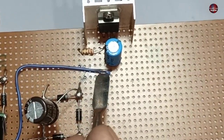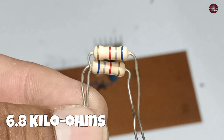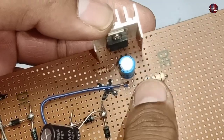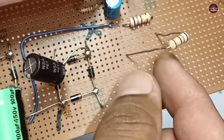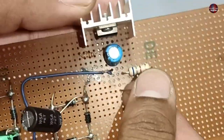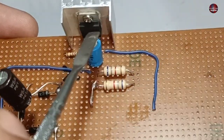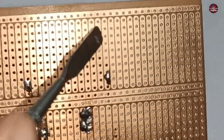As you can see, I have changed the position of the jumper wire, as it was at the back first. Next, we need two resistors of 6.8 kilo ohms of half a watt, and I will use them to make a potential divider, which will divide the voltages. We will install the first resistor at the regulator output or positive capacitor point. I have inserted the first pin and the second anywhere in the Vero board. Now I will install the second resistor with the first resistor on the right side, and the second pin with the ground, which is the center pin of the voltage regulator. It could be grounded anywhere with the neutral point, but this is the nearest point. As you can see, I have used the jumper wire, installed it with the voltage regulator's output 15 volts pin, as I could not solder more connections on this area of the Vero board.